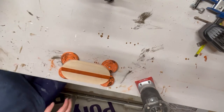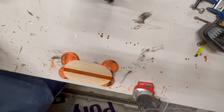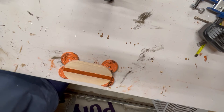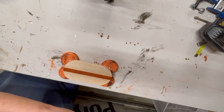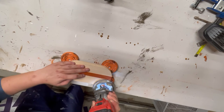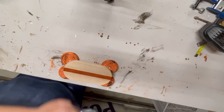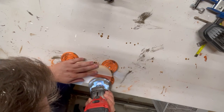Yes, that was a Star Wars joke. Now that it's all sanded and prepped, we're moving over to the workbench for finishing details. I've got my router here with a little chamfer bit — I'm just going to add a chamfer to the top and bottom. I like chamfering; it makes it feel all nice and together, it breaks those hard edges, and when you give them a sand they turn out very well. I just don't like rounding over stuff — it feels weird. But that's personal preference; if you don't want it chamfered, do whatever you feel.